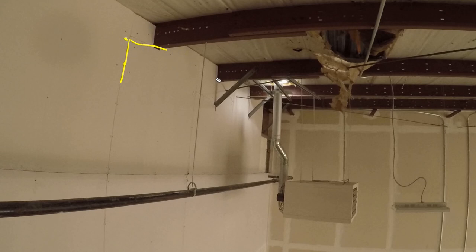These girts here, you have to cut them up and into the inside of the girt here, right? So there's going to be a few different measurements you're going to want to get, but you get the bottom one squared over, and then you're going to want to get this mark, and then this mark. There's going to be three ups for a girt. That's for the up, and for the over, the same thing. You're going to want the outside of the lip, the inside of the girt, and then the outside. There's going to be three marks for that as well.